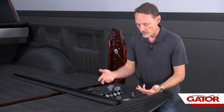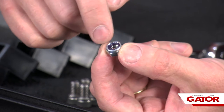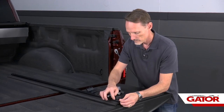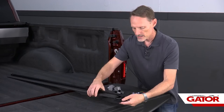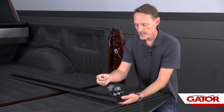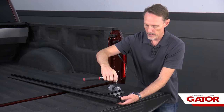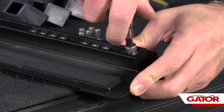In your kit you're going to have a bunch of hardware. First thing we're going to find is our nylock nuts — they've got a nylon band on the top side. We're going to insert eight of those nylock nuts into this channel. Then we're going to take our end cap and slide it right over top of the end of our rail, slide one of the nylock nuts underneath that end cap, and take one of the provided Allen head short bolts to thread down into the nylock nut. Use a quarter inch Allen head drive to tighten that down — just get it nice and snug, don't over tighten it.